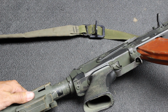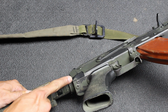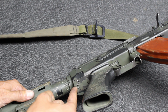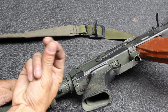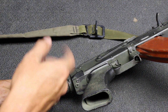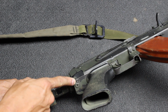So what we ended up having to do was we basically drilled through the fork, which is dovetailed into the adapter, right? We drilled all the way through that hole, got that pin out, drilled all the way through to the buffer tube, right? And then we just glued the two halves together rather than trying to tension fit them together, because we threaded it, dyed it, and put a big ass screw in the center and then supported it with a second screw, right?